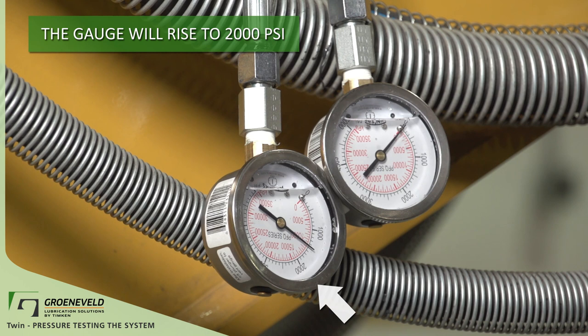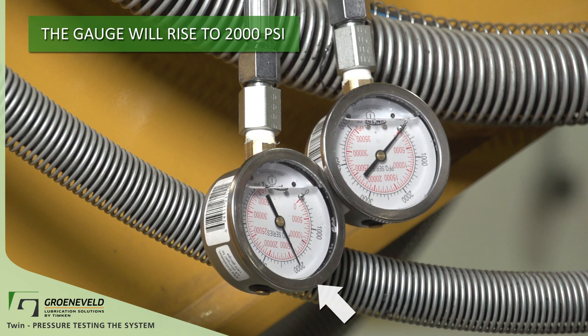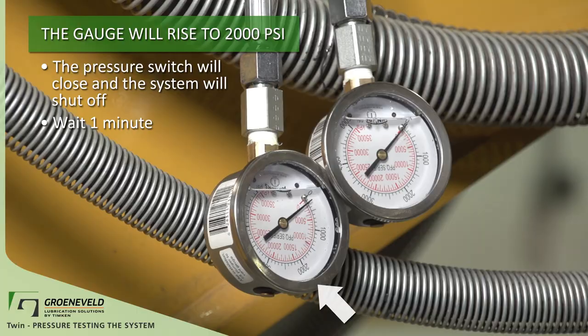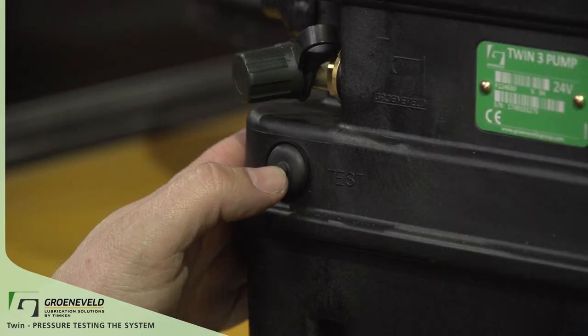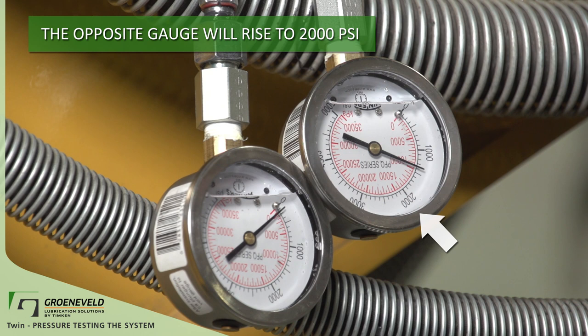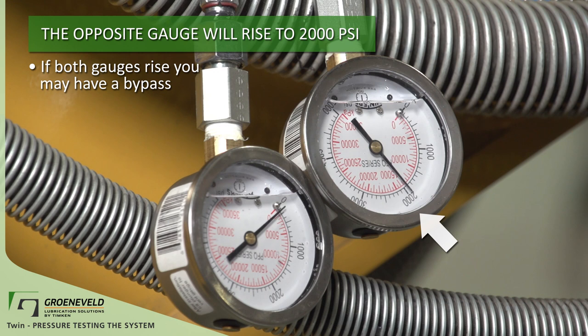This is because it takes time to push the green lube grease to build the required pressure. Pressure will start to rise in the system. Once the pressure hits roughly 2000 PSI, note that it stops — this is an indication that the pressure switch has closed and the system is shutting off. Once this happens, wait one minute, then press and hold the test button for three to five seconds to generate another cycle. Grease pressure should rise on the opposite gauge up to the 2000 PSI mark. During this, pressure should only rise on one of the gauges — if it's happening on both, you possibly have a bypass situation.